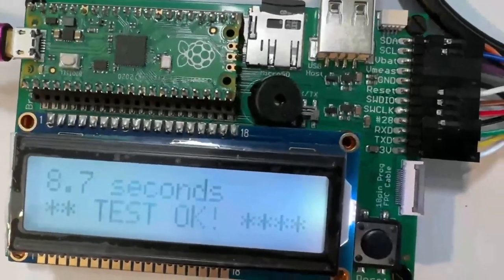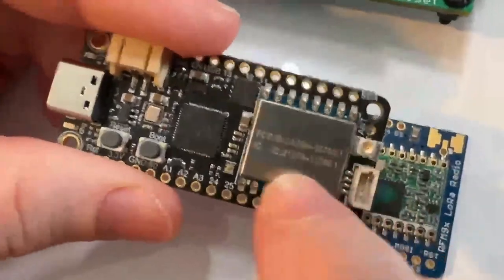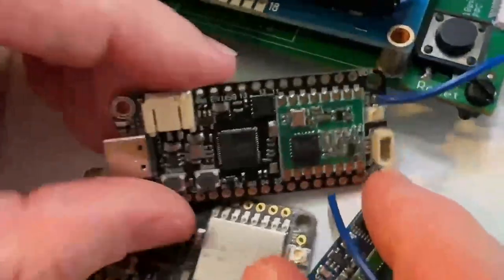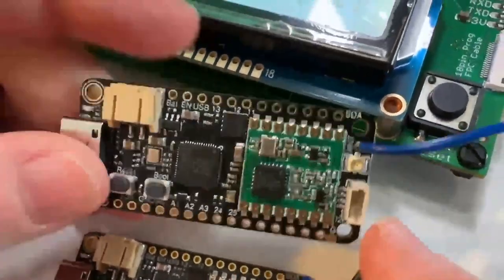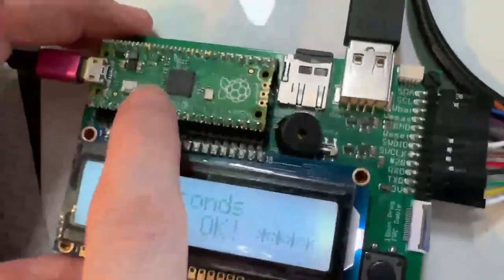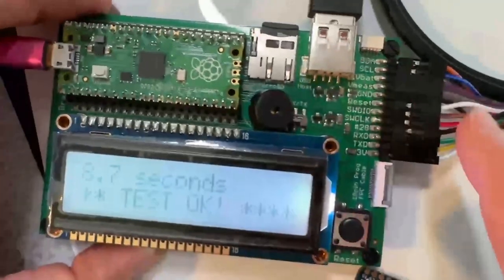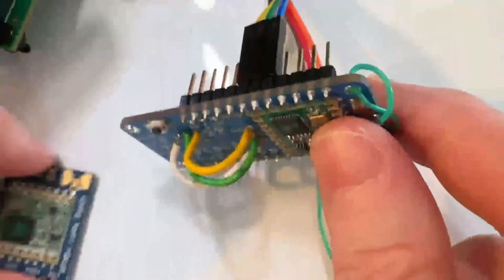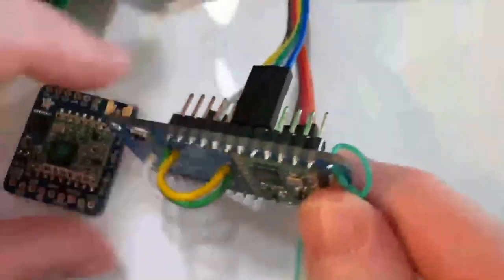This is me designing the tester for our new RP2040 feathers with radio modules on the end. This is a LoRa 900 megahertz RFM95. We've also got the version over here where we have an antenna soldered on the RFM69, which is a packet radio version. The tester brains uses the Pico with an SD card which has the firmware and then it connects to one of the modules.